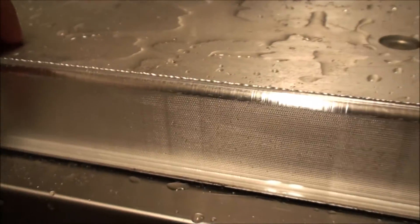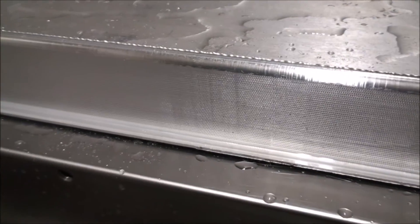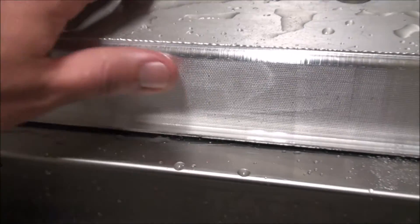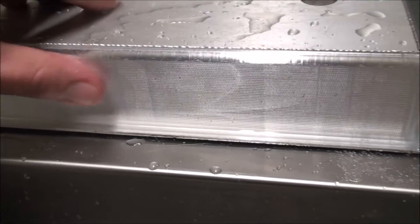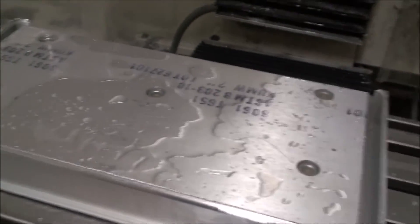Here's what we've got. I've got the bolts in - that's where they'll be. The side I just did with a roughing end mill so it's got this texture to it. I was afraid the texture wasn't going to be very good, but it's actually kind of cool looking - it's almost like knurled. So I may end up just keeping that instead of trying to mill it off. I have to cut that off when I flip it over, and I'll start the next operation in the morning.